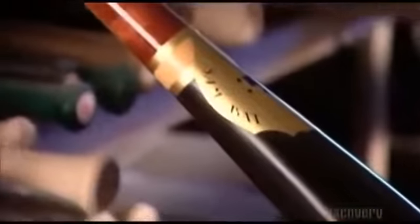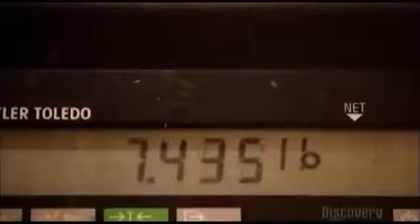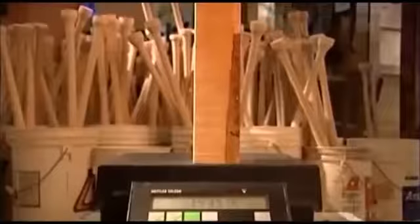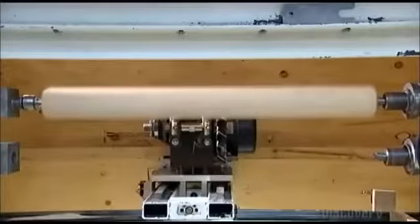Barry Bonds cracked a home run record in 2001 with a wood bat like this, one made of maple, instead of the usual white ash. They can never tell just by looking at it that a chunk of maple has what it takes to make a good bat. So they weigh it to make sure the wood is really as thick and heavy as it appears. Next, pointed prongs grip the wood and spin it, while a carbide cutter rounds it.